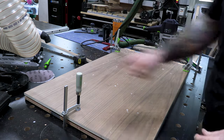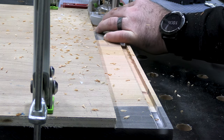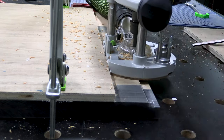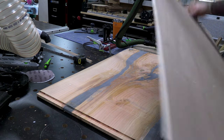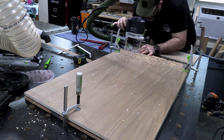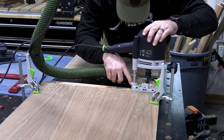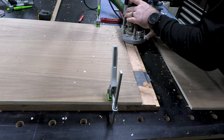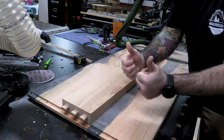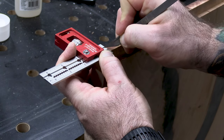One of my favorite things about woodworking is making solutions for repeatability and accuracy — that satisfies me at a very deep level. When making the tenons on the headboard, I had to ensure they were the same distance in from the edges: to match the stringer width, and to keep the front-to-back distance equal on each side. I made test pieces and cut a piece of plywood to the exact width, aligned it with the top, bottom, and one edge of the headboard, and ran my router right up against it for a perfect flush cut. It worked out really well — fist bumps.